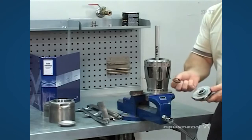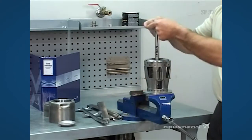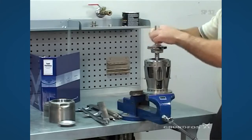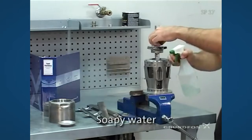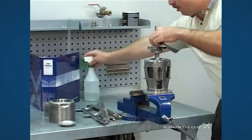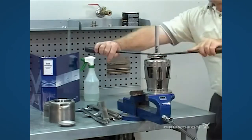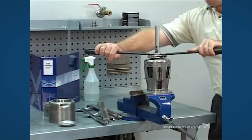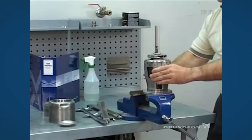Make sure you tighten your shaft back up. Take the impeller, remove the up thrust washer so as not to damage it when you put it down. Slide the impeller down, and just before seating the impeller, apply a nice squirt of soapy water. Take the driver underneath to pull that up, firmly seating it in place. The inlet shouldn't lift at this point.